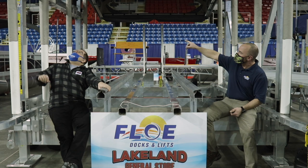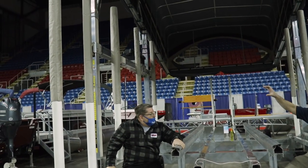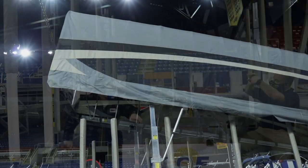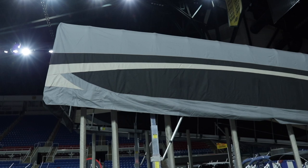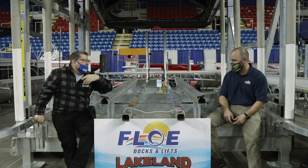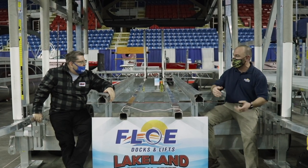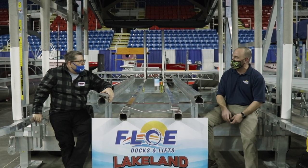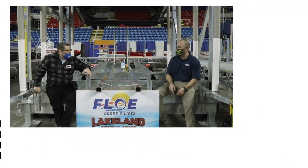So in that tube there, Dave — the entire length — is a screw. And on the end of that screw is a ball, and the cable feeds up in there and hooks on there, and it just pulls that all the way across. So what's the value in that? The value is, it's exponentially more durable. It's also a lot more efficient. Typically a boat lift gets about 30 ups and downs on a single battery charge — with the VSD, it's 177. That's how much more efficient it is.